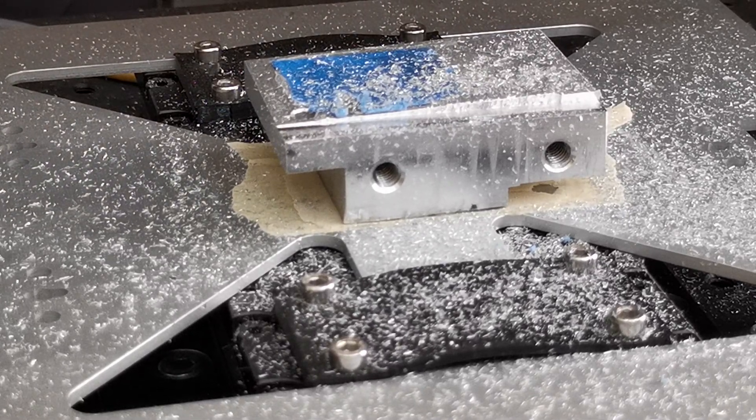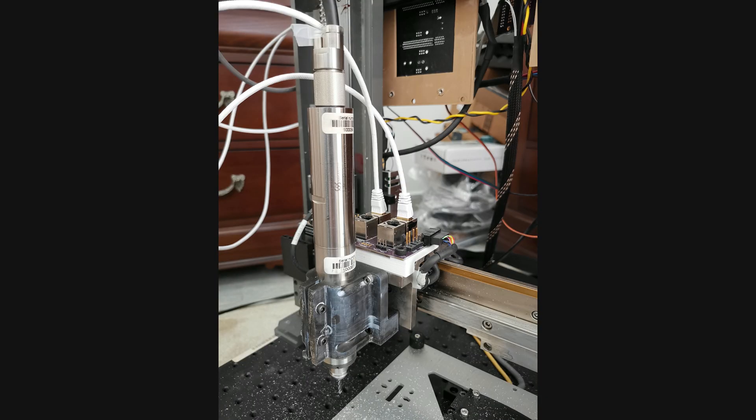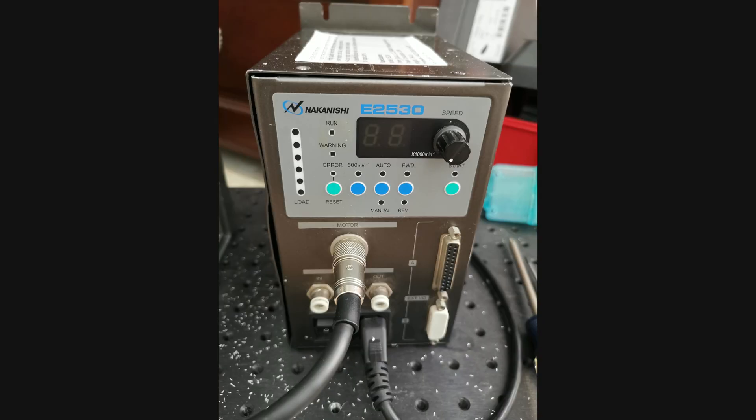The spindle itself does not show any signs of overloading, but the linear motor controller was tuned for 3D printing and cannot keep up with this load. In any case I am confident that the spindle itself with this controller can comfortably mill aluminum at 2 mm depth with 1 mm of step over — possibly quite a bit more.